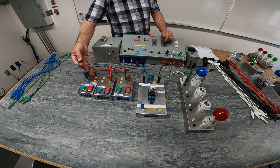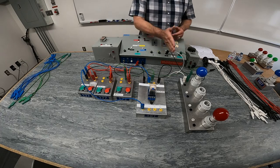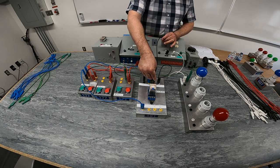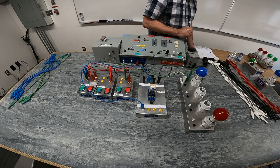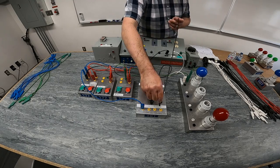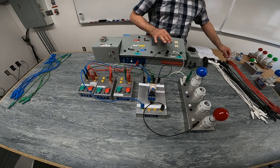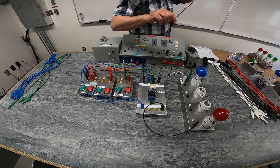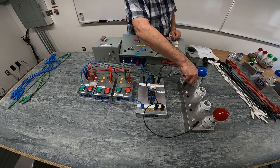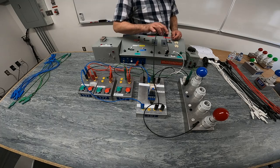The other side of my normally open push button connects to number three, which is a normally open contact — and this becomes my holding contact. So my low voltage side is now complete. On my line voltage side, I'm going to feed my 120 volts into my other armature at common number eight. For light one, I'm going to come out of terminal number six, feed into that load. The other terminal is the normally closed side. So that was my normally open; this is my normally closed, which goes to my second load. So I'm using one 120-volt supply.